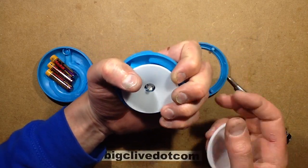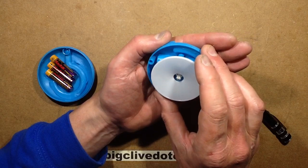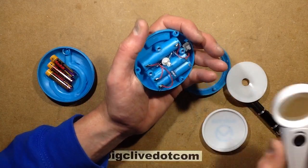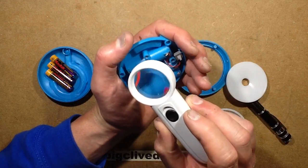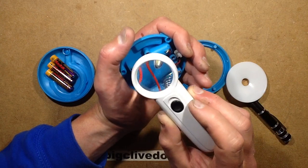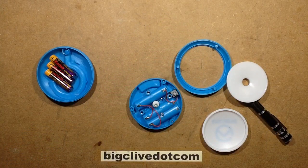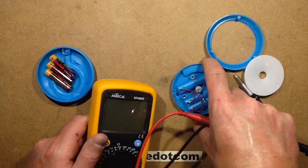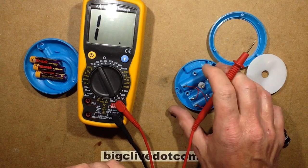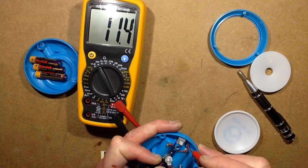The switch position at the side is a bit of a bugbear, but I don't think there's much other place they could put it. I'm going to change it for a warm white LED, and also work out the resistor value. It's brown-black-black-gold — a four-band resistor — so that's 10 ohms. It's pushing that LED quite hard. The temptation might be to increase the resistor value to make it last longer as a dimmer light.